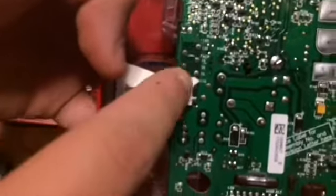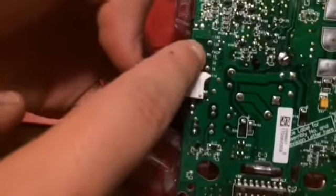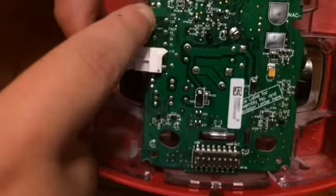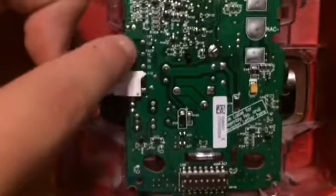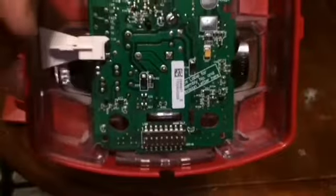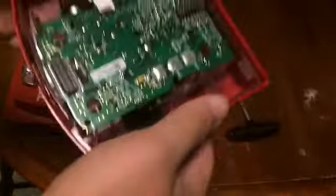Here's the inside. You have your little Candela selections: 110, 75, 30, 15, FACP, 135, 185. If you guys do not know what FACP means, it stands for fire alarm control panel. And then you have these little dip switches here as well.